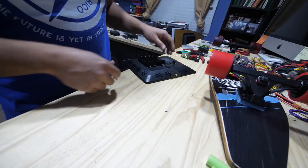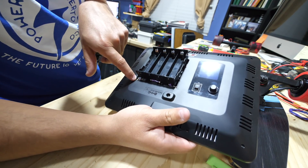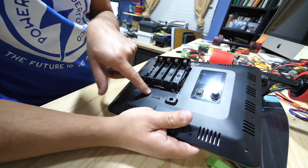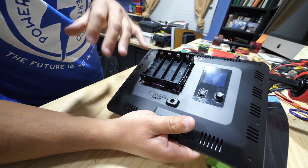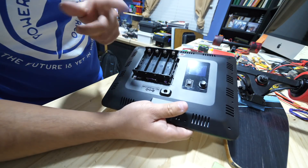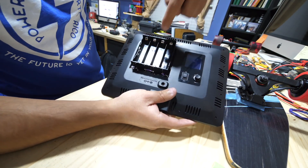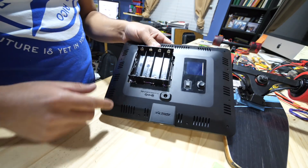Alright, now that we've installed that — I took this light apart before to see how it was wired. The pin on the far corner is negative and the positive is over here, and the two of them just connect together, which means it needs two batteries in series to run. That translates to four of these 18650 cells, because those batteries have two inside in series. So: negative, positive, positive to the next one, negative — it splits over and that's how you wire it.